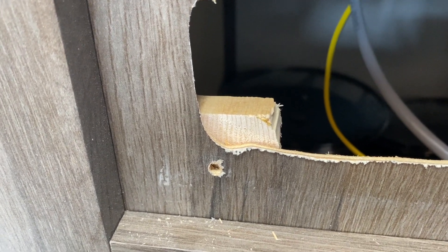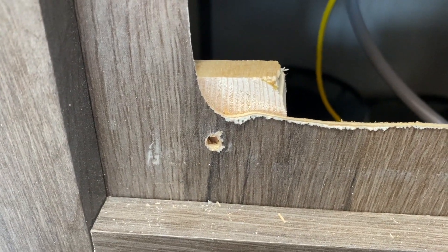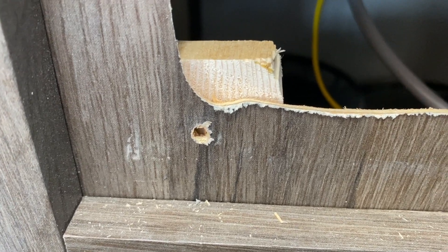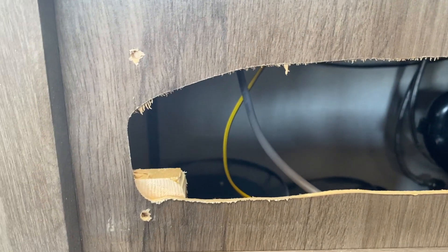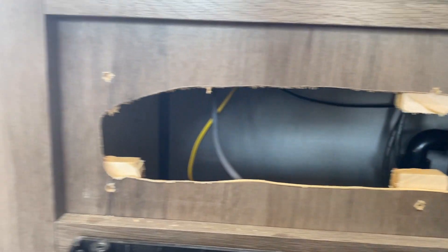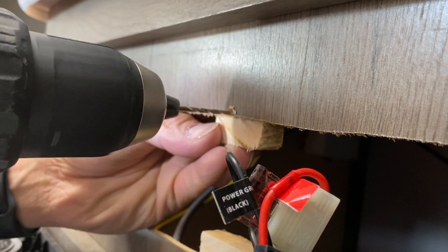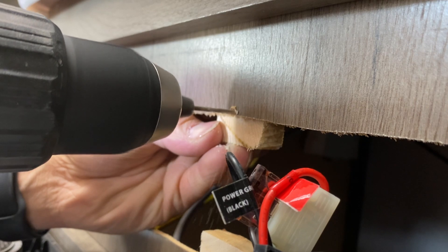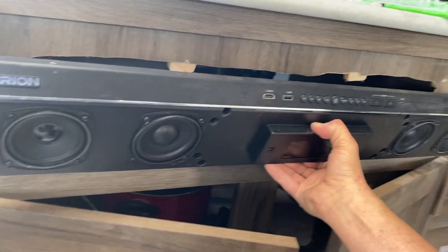This new fresh wood gives those screws somewhere to go in so this thing won't fall back out again. I'll pre-drill these so that the little biscuits don't split — if you don't pre-drill, that's what will happen. The biscuits are in place. You can see that'll help here where the hole was only just nipping the wood. Now I'll pre-drill these so I can put the screws in. Holes are drilled — I'll just be able to slide this in.